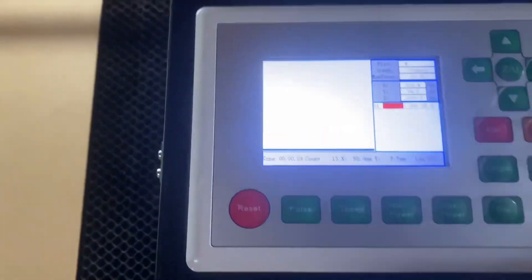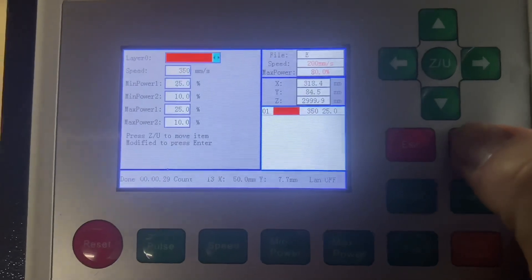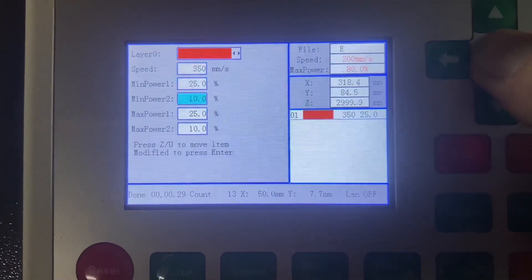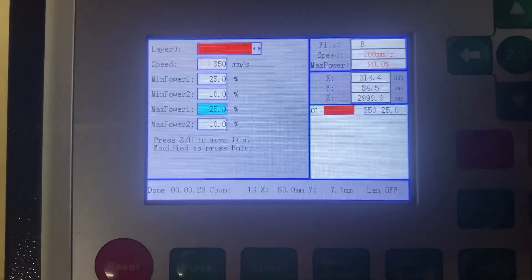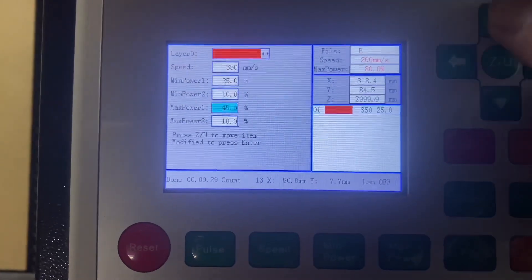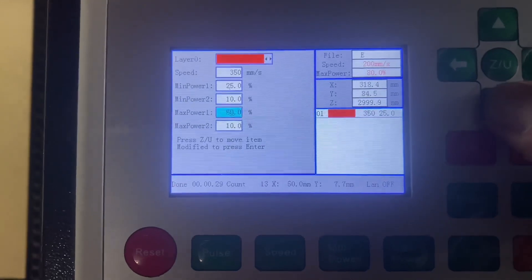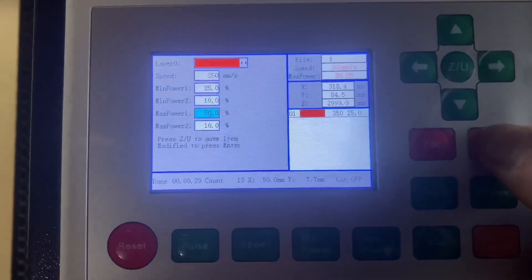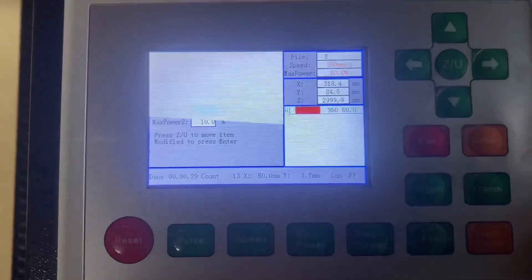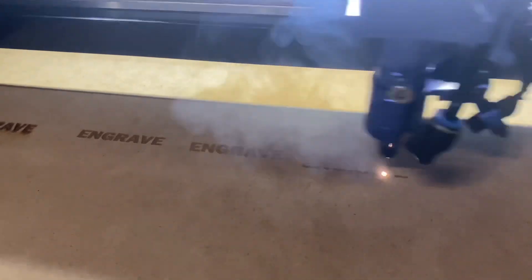You can clearly see there that one is really quite light. I'll set that origin and pop back over. This time, exactly the same way - just hit that enter button, brings up the menu. This time we're going to leave it at 350 and go down to the max power one and change that. I'll go 50 - so it was 25, now it's 50 - but we're going to leave the speed at 350. Go ahead and hit enter and you can see there it's 350 by 50 as far as the power goes. This one's still moving quite quickly but the power has been doubled, so this should be a darker engraving than the last one.